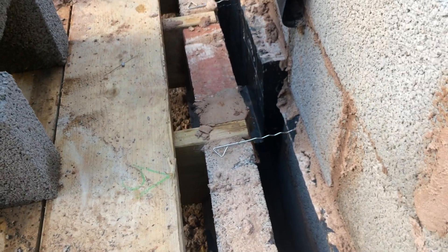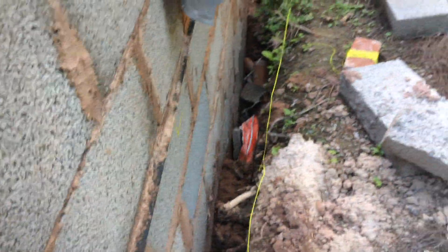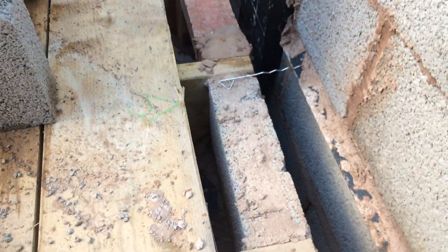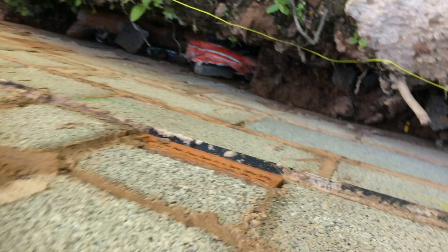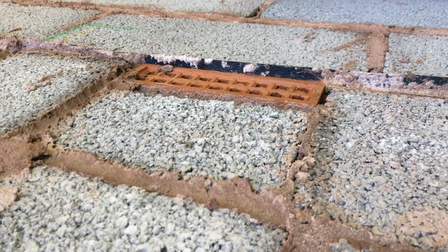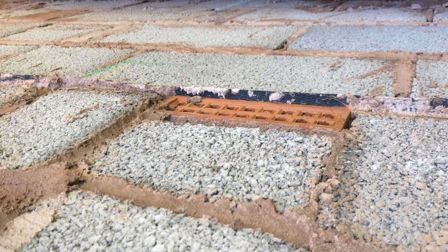There's our vent down there and that goes through the wall and out the other side through the vent brick. There's a hole down here where it vents in or out — the air flows both ways I guess — and then we've got another one on the other side. That's where you put your brick, and you should make those a bit proud of the brickwork really so they're flush with the render when you're finished.